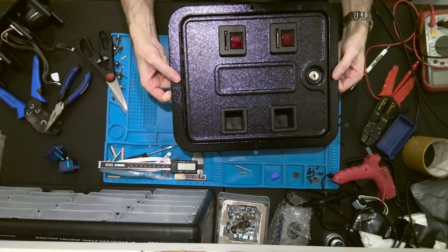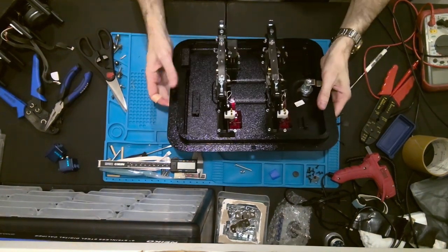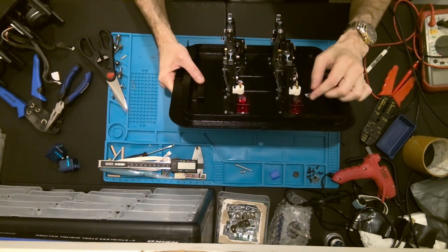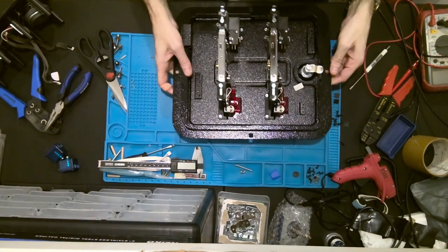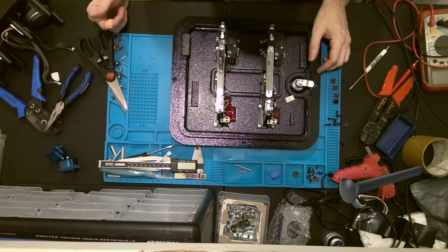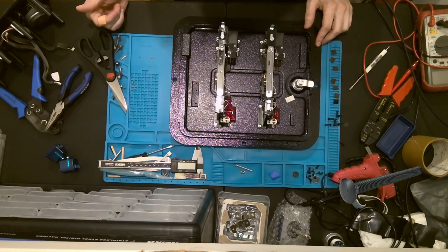Here's a different style door I decided to go with for my Tron cab — this is more of a horizontal style door. The internal mechanics are no different than the previous door, however the primary difference is the bells and whistles. This one gives you standard bulb-style lighting for your reject buttons but there's no pre-wiring and no USB port, so you're on your own to figure out wiring. The second difference is that you use four bolts that go directly into the cabinet rather than brackets, so this style does not care how thick your material is. You can connect it through the kick plate of an Arcade1Up or through a 3/4 inch panel — either way, this one is more versatile when it comes to installation.